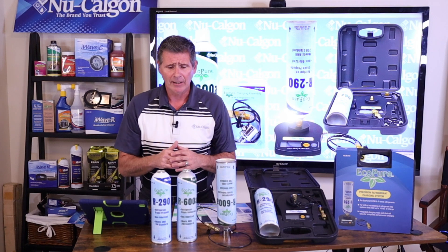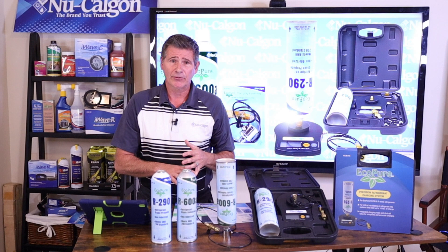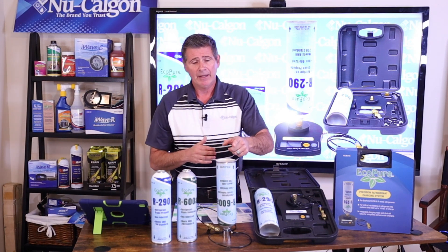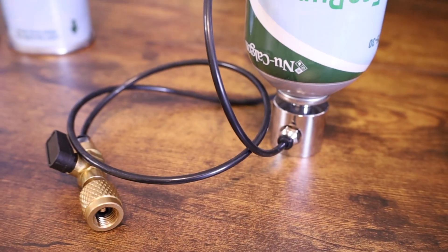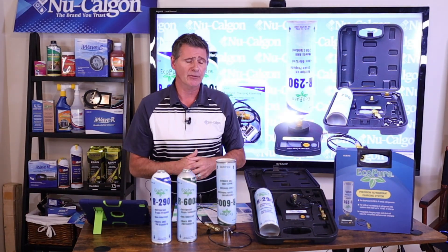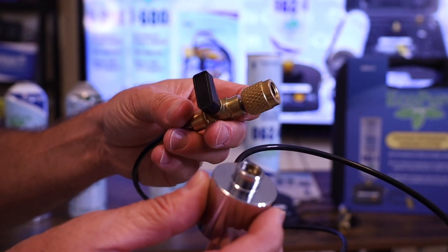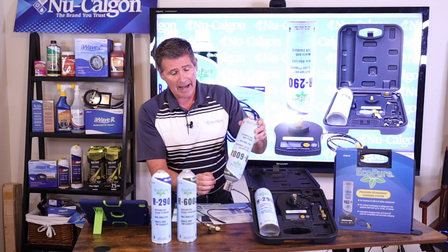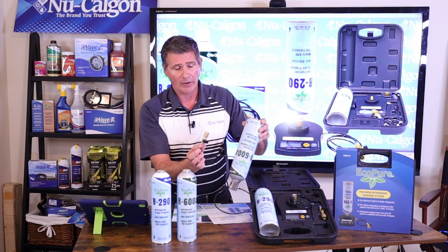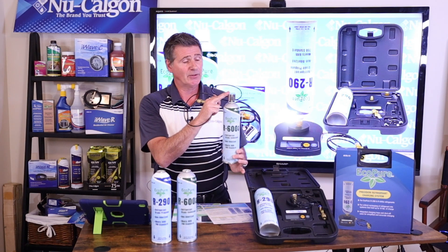That's fairly small — that's what these refrigerants are for. You have to weigh these out when you're charging a system of that size. The first product is our charging assembly. This is for contractors who already have a scale — they have an existing scale and they're already using these types of products. The charging assembly is this large weighted end that attaches to the can, with the hose and the assembly on the end with a valve fitting. The contractor is always going to hold the bottle upright when attaching these items.